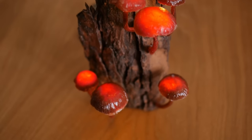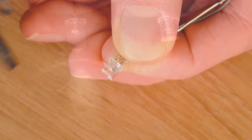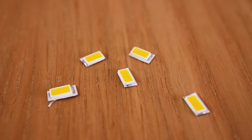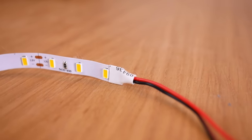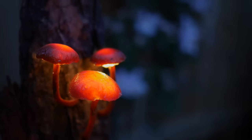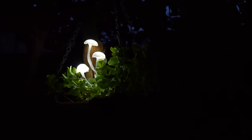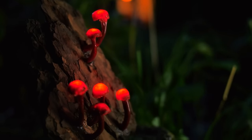This means that the mushroom domes will be lit up much more evenly, although you can achieve a similar effect with normal LEDs by simply chopping off the tips. SMD LEDs can be bought individually, but they are much less common, so what we'll be doing is removing some from a cheap LED strip. This works out quite well because it also makes them easier to solder. When choosing your LEDs, it's a good idea to go with a colour that matches your final mushrooms, as it will help them look more vibrant. For example, if you're making red mushrooms, going with red LEDs would be a good idea.